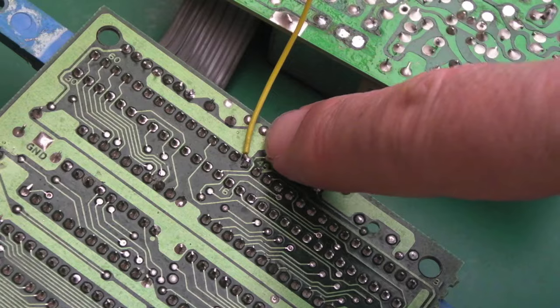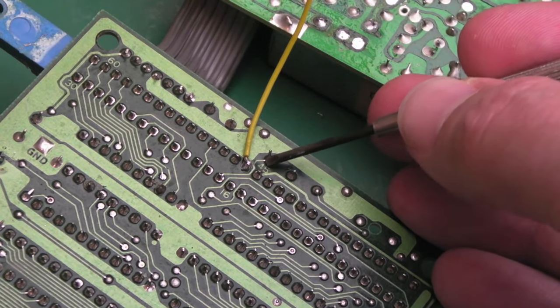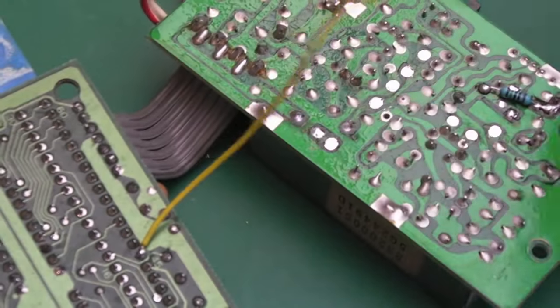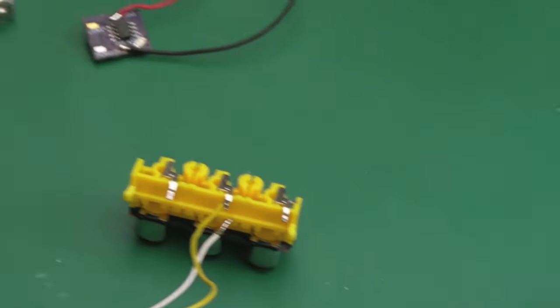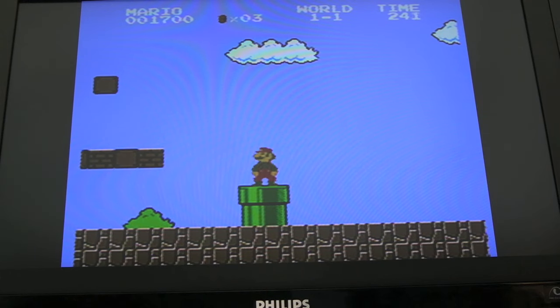I'm near the end now — I've got the sound output going from pin 46 on the cartridge port, which is actually marked as 45 on the PCB mask. Just temporarily I've got it going to a test connector. As you can see, it's working, and the mic on the second controller is working too. Turning it back on, it's picking up noises from the TV — you get pops and crackles — so I've switched the mic off.